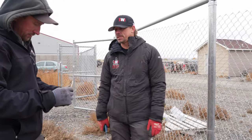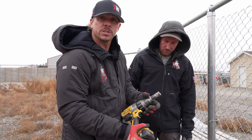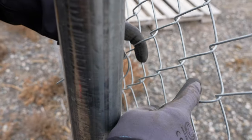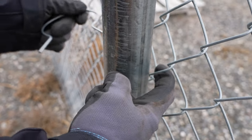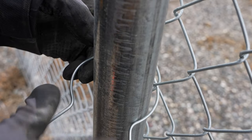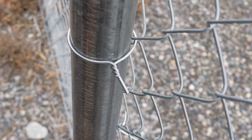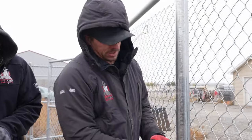Dan, would you please demonstrate what it looks like when you use an easy twist? There are imitations but there are no substitutes — we'll put a link below for the ties and the tie tool. With chain link you have a link that's far and a link that's close. Take the link closest to the post, slide the tie around the post, go around the link, pull it in right there, pinch the tails together, pull on your trigger, and tie it.